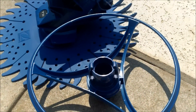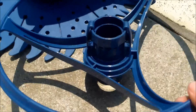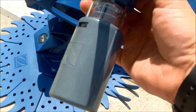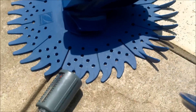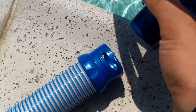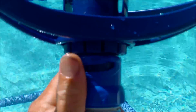At this point the cleaner is still disassembled — we're going to check the flow now. If you take the wheel reflector, you'll see two clips under it, and the flow gauge just clips right in there. If you remove it, simply push the two tabs and the flow gauge will come right out. I have that connected to the side port here. With the reflector and flow gauge attached, we're going to connect it to the hose that's going to be attached to the cleaner. Now we're going to go ahead and test the flow — lock that hose in place.